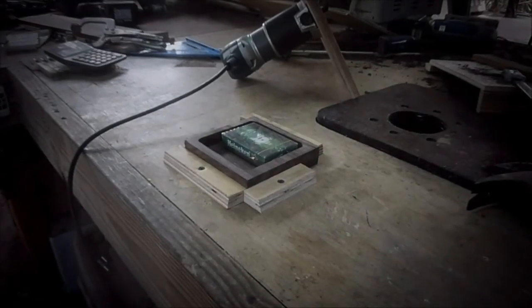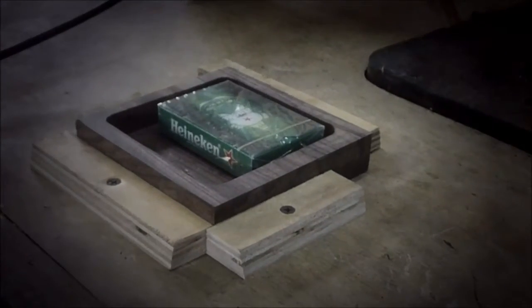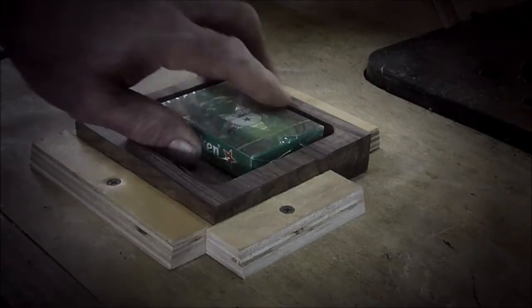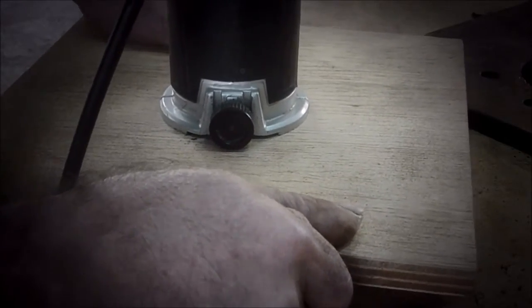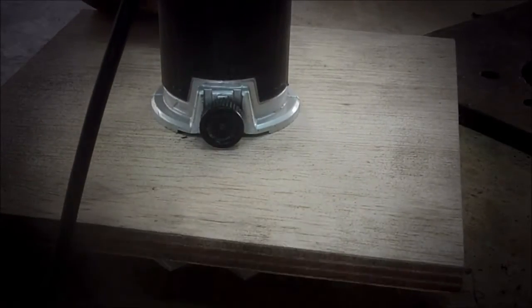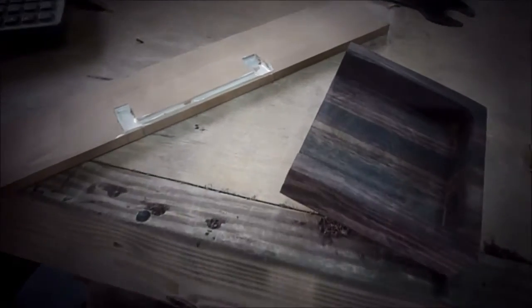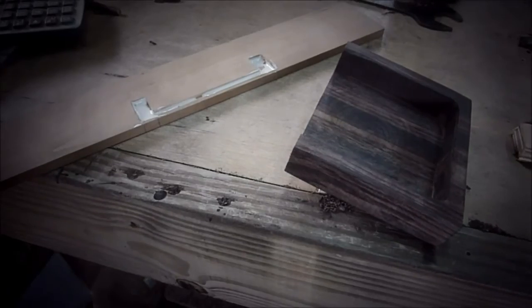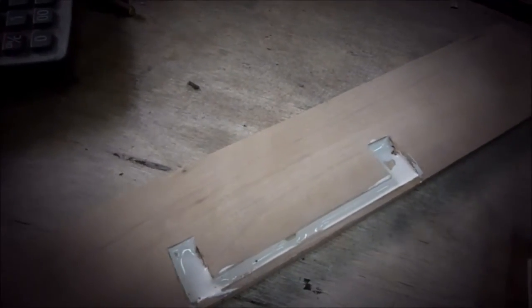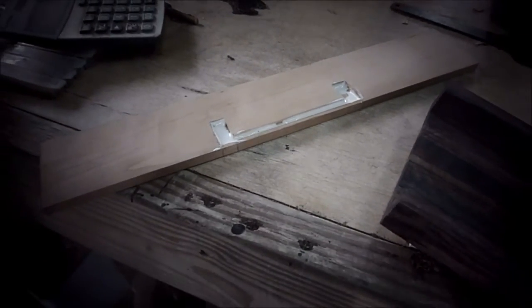So now we're making a drawer to hold the deck of cards and those pegs, and you can see that I've got to plunge just a little bit deeper. I'll do that right now and call that done. Well, it turns out I started work too early this morning because I made the drawer too deep, so I had to cut it, and now we're going to sink it into a cherry drawer front. We've dadoed out the shape, and that'll glue right in and actually be stronger.